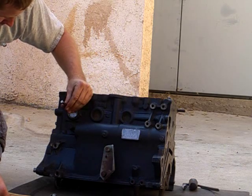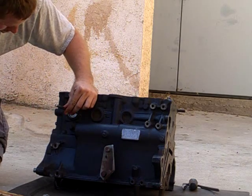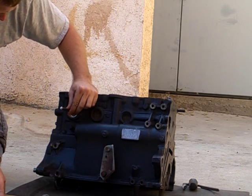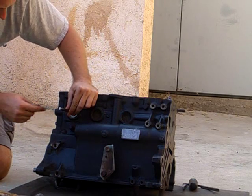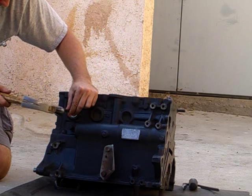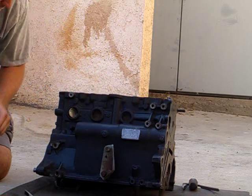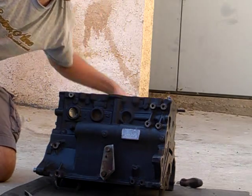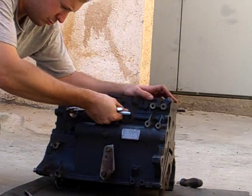Take the punch and put it on the outside area of the plug where the wall meets the face at the 90-degree angle. What you want to do is get the plug to cock out at an angle like that so you can grab it with your pliers, and then you should just be able to pull it out.